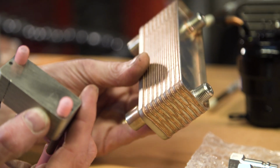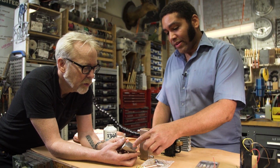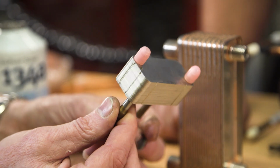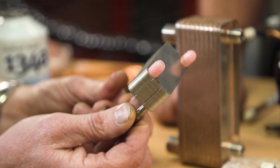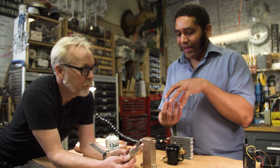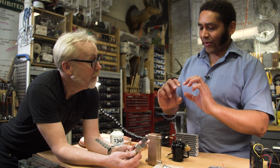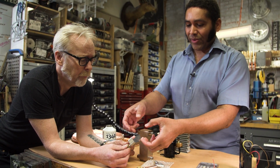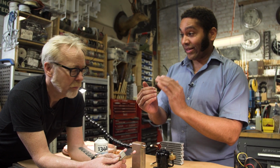The brazing process, you could do this with a torch, but doing it in a furnace gives you good uniformity. This heat exchanger is also steel plates, but these are flat steel plates, and the channels have been etched out of them. Those plates are thin enough that we can use etching processes, and this is then vacuum furnace bonded. The bonding process involves heating up, you put a dissimilar metal bracket around it, and when you heat this, the steel expands more than the bracket does. So as the steel is expanding, the bracket creates a compressive force that diffusion bonds the layers of steel together.